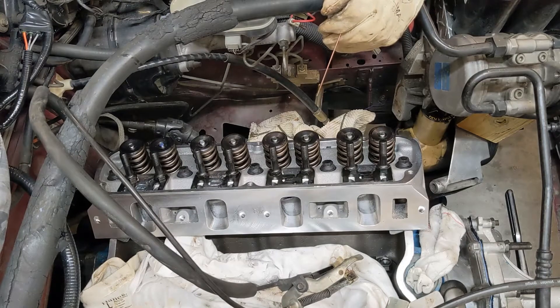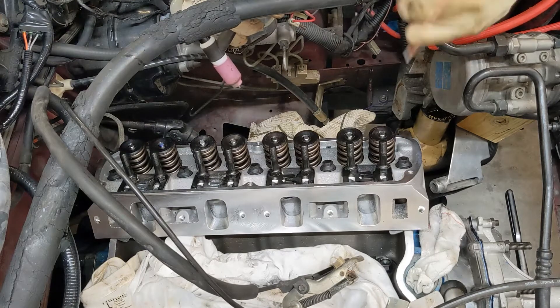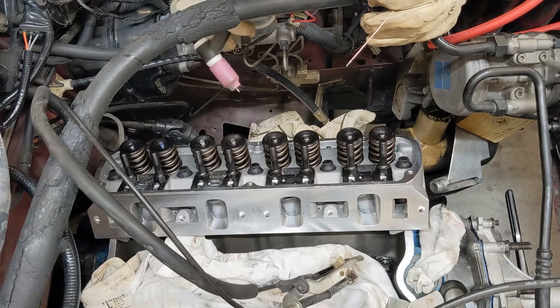Well, if you do that they're going to warp while they're on the table, and then these hardened plates — my gosh — when you go to tighten them back down they're going to crack and bust. I think they were mostly talking about MIG welding though, with all the spatter from MIG weld. So that's why we're TIGging.